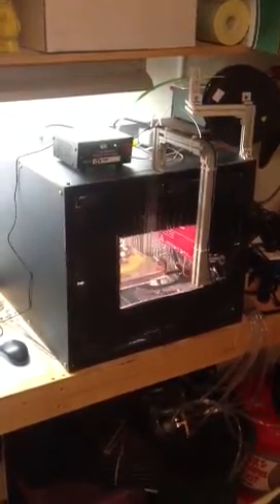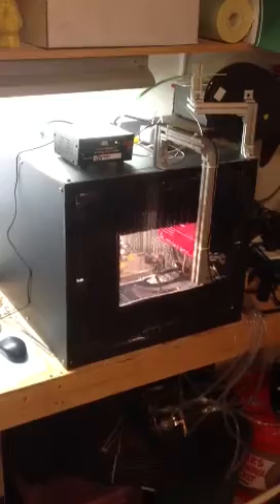I'm running my 3D printer with an enclosed build chamber, heated now to 70 degrees Celsius. I'm down to 200 watts of light bulbs plus a heating plate to keep it at that temperature. You can see right now I'm printing a Stanford bunny at two times normal size.